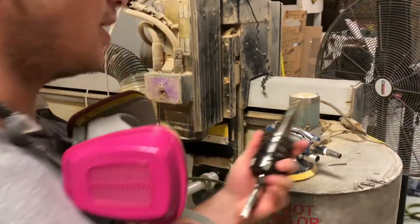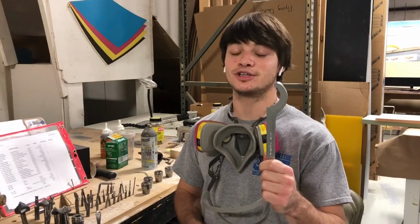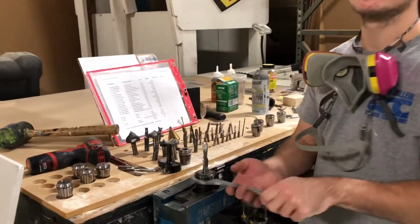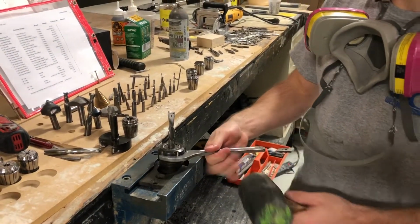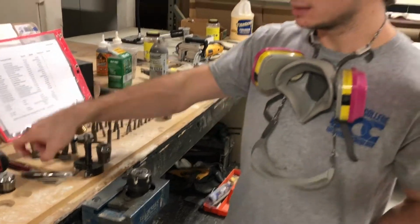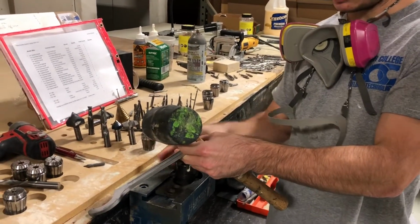We're going to take our tool 5 and we're going to replace this flat bottom surfacing bit with our flat milling bit. So you want to take your big O church key and put it in the lock. This isn't going to open so easy, so we're going to use our mallet to open this up. Just enough to loosen it up, and it usually takes 2 times. Tap it again and it's loose, and that'll come right out of there. You put your bit aside, and we're going to put our milling bit in there. Tighten it up real good.